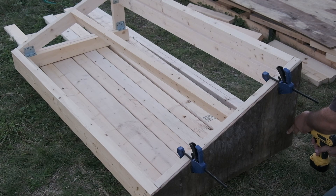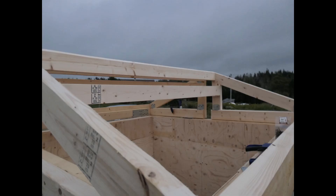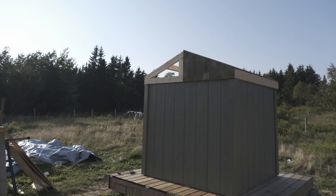What we're going to do from here is put each roof side on top of the observatory and just let it provide shelter to the equipment. When the liquid rubber eventually arrives, we'll take the roofs back down and paint on the primer and the liquid rubber. A day later the roofs will be ready to put back on top. We'll bolt down the inner rails and set up the safety shock absorbers and the landing pads for the roof. Then finally I can do a door, and the observatory is done. It's about 95% done now — it's hard to believe this project I started at the beginning of summer is coming to fruition.